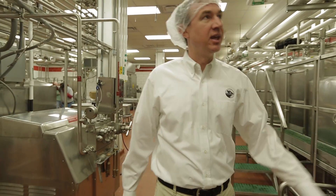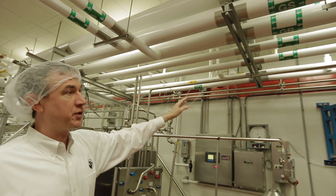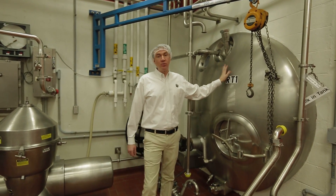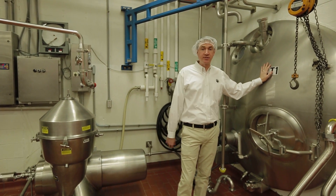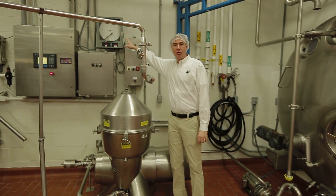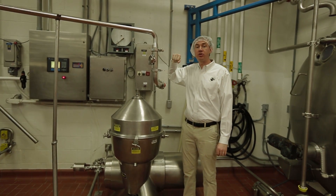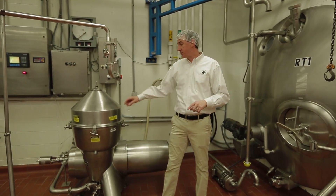Let's talk about raw milk storage and pasteurization. If you look at our wall here, you'll see stainless steel pipes — those will feed the tank truck into our raw bulk storage tank. RT1 holds about 2,500 gallons of milk. We can store that milk for just a few minutes or overnight at around 35 degrees. Our chart recorder will monitor temperature overnight so we know there are no temperature aberrations. From our raw storage tank, that'll feed our separator.